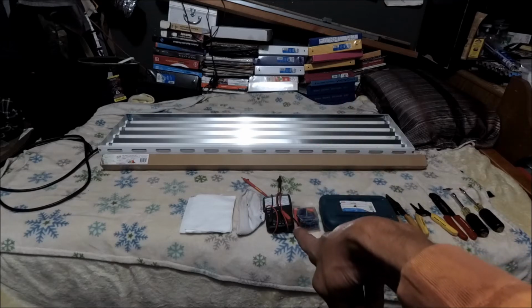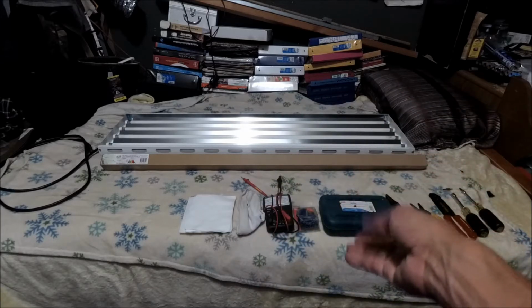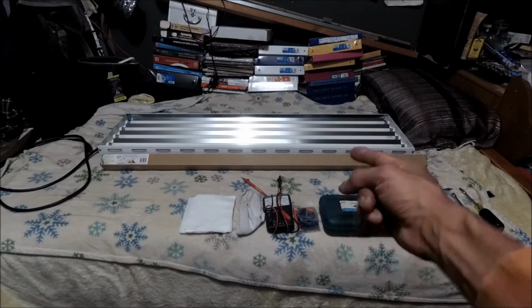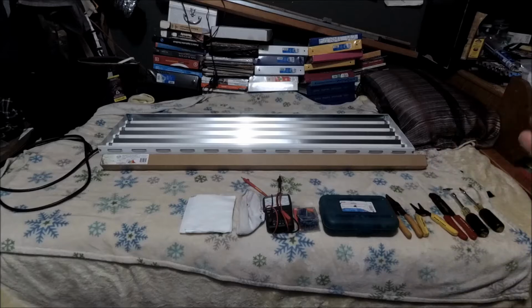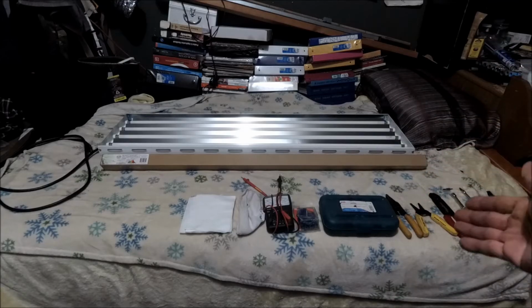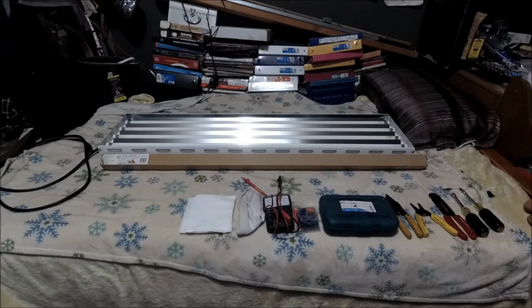My meter to take the continuity test for the non-shunted or shunted lamp holders, the tombstones. My butt connectors, or butt splices, to join my conductors after I make the splices or the cuts, and then my wire nuts for my two- and three-way splices, and for the loose ends of the conductors. And then I bought an extra crimper stripper combination. I have two different combination crimpers, strippers, and all that. One from Klein and one from Ideal.